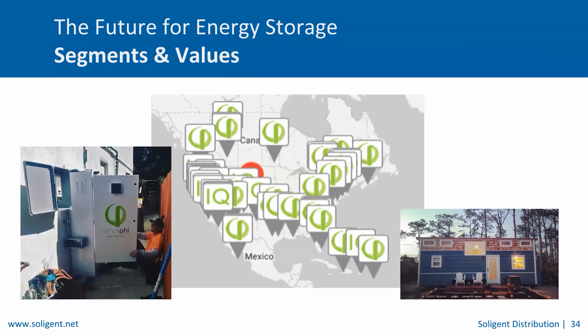Shifting gears, this is an installation in San Diego. And as you can see, this is a DC coupled install. You can tell this is DC coupled because here's the extension box, and this is a charge controller. So this is a Schneider installation with a Schneider charge controller to the left of the Access unit. That means the PV is going to be directly tied to that charge controller, feeding the Schneider XW inverter. In this case, there were two charge controllers used, with 10.2 kilowatt hours of batteries.